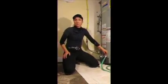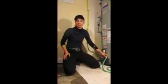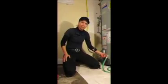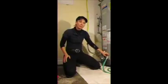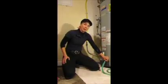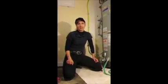Hi, so if you're watching this video, it's because you've got a plastic drain valve and you want to be prepared in case it fails while you're trying to drain your tank. The way that these most commonly fail is that they don't close all the way again and are suddenly perpetually drippy. The way to get around that is to prepare yourself by making a quick trip to the hardware store before you drain the sediment from your tank.